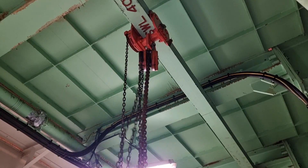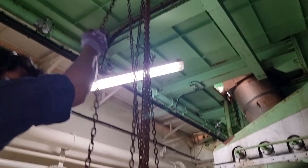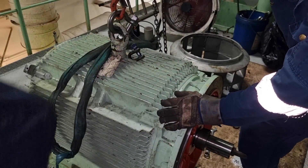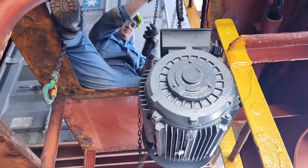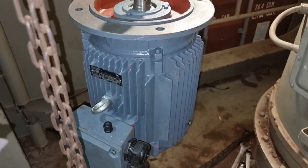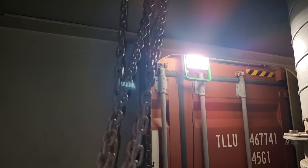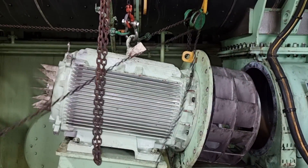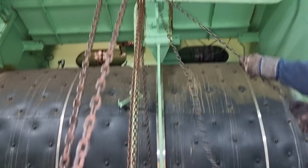Regardless of its size, the principle for checking an electrical motor is the same — do the insulation resistance check, line-to-ground, and line-to-line, and work in a safe manner especially for big motors. Use proper lifting tools and check if they are still in good condition. Be nice to every crew because they are the ones who will help you in difficult or heavy lifting jobs. Thank you all for your support — we are now almost 32,000 subscribers. I hope you learned something from this video. This is your Lucky Jake, see you.